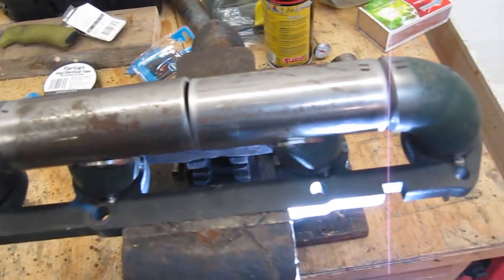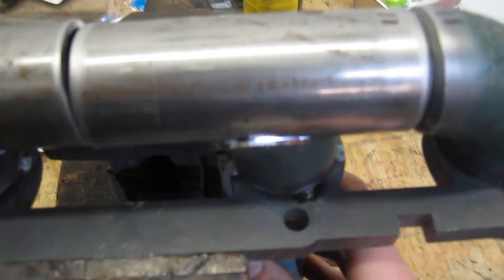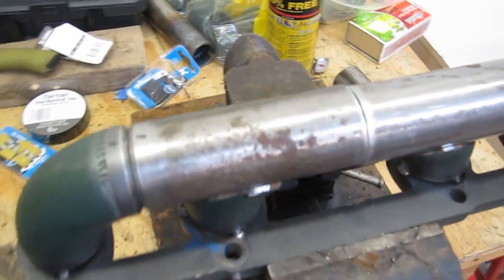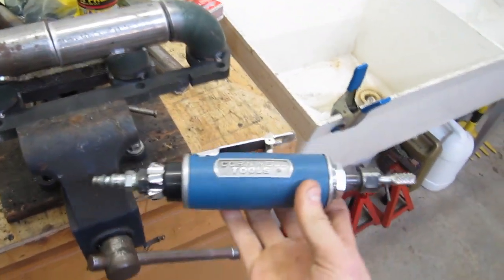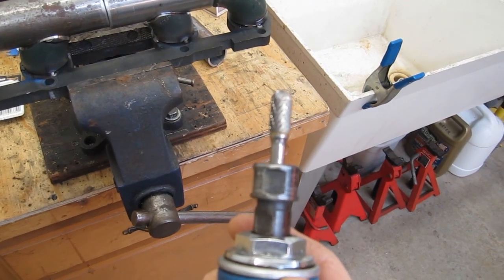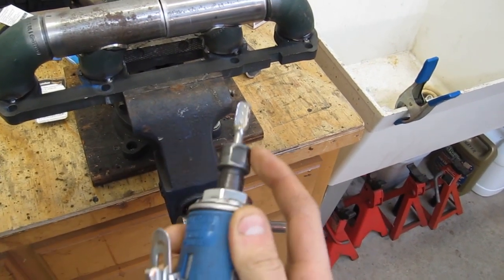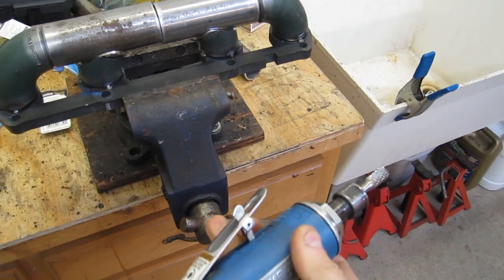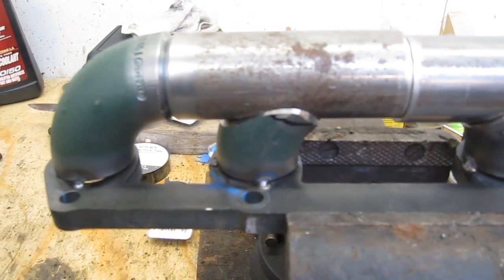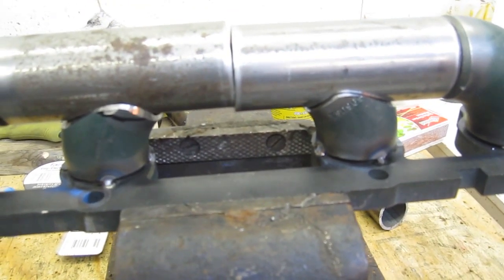As I was making the notches, I used a flashlight and shone it up into the runner so I could see my gaps and where I needed to trim — that was an easy way to figure out how to notch it. I used a die grinder with some Matco carbide bits, which cut really well. Did the rough cut with a cutoff wheel on the same tool, then switched over to the carbide burr for the finishing cuts and got it tapered so it's ready to weld. The joint is nice and tight, so it should be pretty easy to weld.